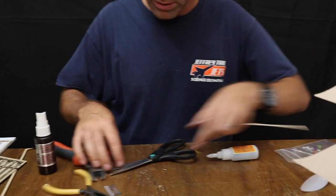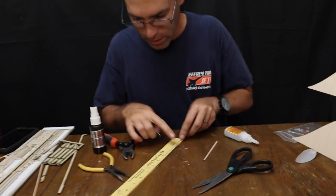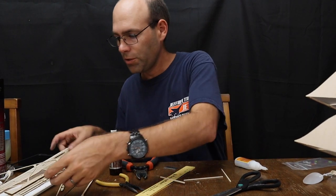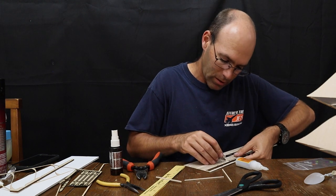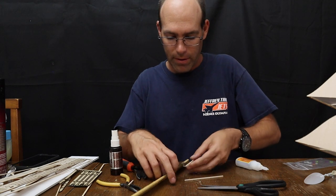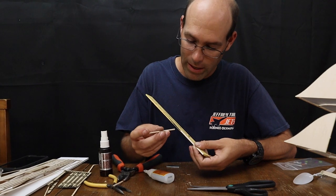Now, take this end of this stick that you have cut out and cut it to a length of 4 inches long. Now cut another piece to the same length. Go over to your wing spar sheet at this point, and these little triangles, these are what are called gussets. Cut out 2 of them. Now find the center of this stick, which is at the 2-inch mark.